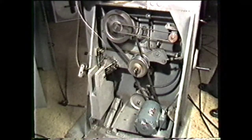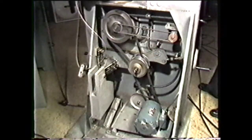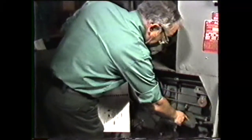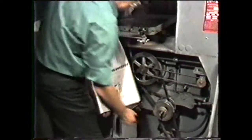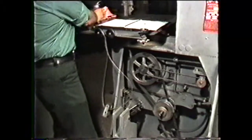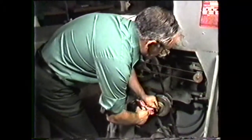The operating control panel turns the machine on or off as the selector indicates. The motor and transmission that drive the lower band wheel are located in the back of the machine. There are a number of lubrication points inside the machine; check the lubrication chart in the instruction manual for these points and lubricate them at recommended intervals.